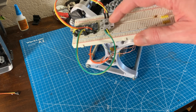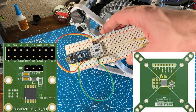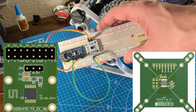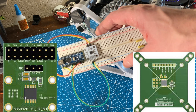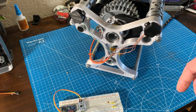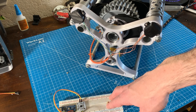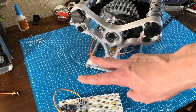AMS offers several commonly used encoders like the 5048 and the 5047, which is the majority of what you'll see used with Arduino projects, but they cost about $15 to $25 each, which was more than I wanted to spend. I knew when buying the AS5600 that it only has a single I2C address which cannot be configured, meaning only one AS5600 can be used per I2C bus, or you need an I2C multiplexer. Luckily the ESP32 has two I2C buses so this wasn't an issue, but it did impact something I'll talk about later.